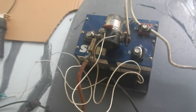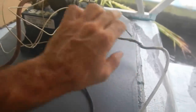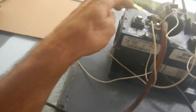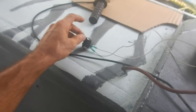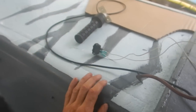I did confirm this thing was functioning recently. This is the battery positive — I might want a fatter wire for that. Battery negative goes here, and then this is the motor negative and I think this is the motor positive. I'm definitely gonna need a longer wire than that. I have to mount the switch and throttle somewhere accessible. I should go check what size wires I'm gonna need.